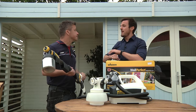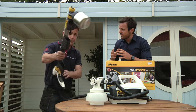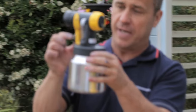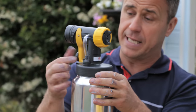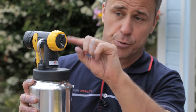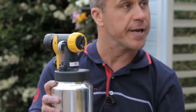We've spoken a lot about big areas like fences and walls, but what about smaller areas like garden furniture? Yeah, absolutely — you use the perfect spray attachment. If I take this off, behind the trigger you'll see a paint flow control. If I'm doing very small or detailed areas, I wind that back and it projects a lot less paint. It still atomizes it so it comes out as a fine mist, and the airflow either side directs where it goes — so very minimal overspray.